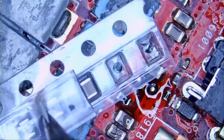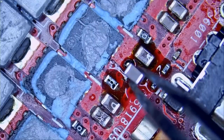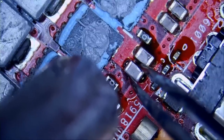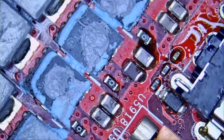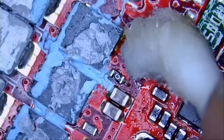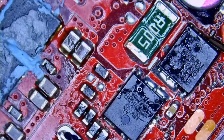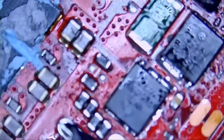Let's grab a cap from here. I did mention it in yesterday's video while fixing an Asus laptop that you can buy those caps off our site — whatever I use here, we sell. If it's useful, we sell it, so everything you find on our site is used here on the bench. We soldered the cap and we are done. Now assuming we do not have anything else on the board that was messed up, the board should work. We are reading 0.34 voltage drop and as the board cools down the number will go up to about 0.42. We no longer have a short and the board should work.